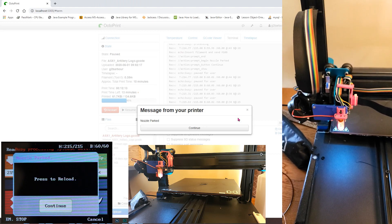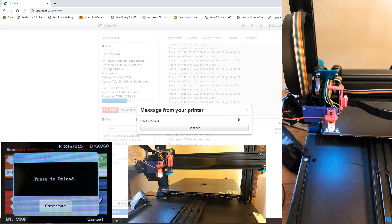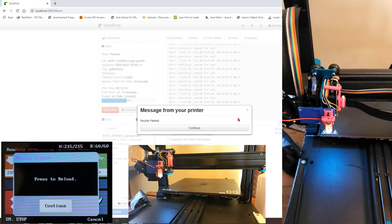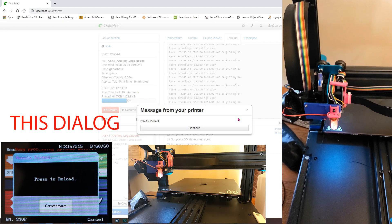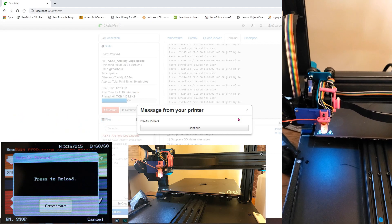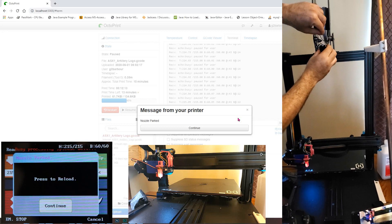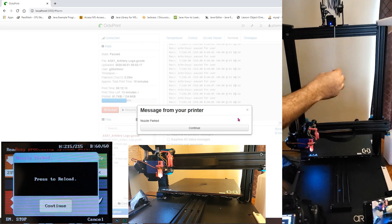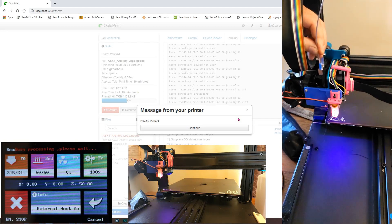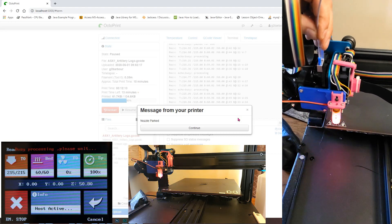There are a few dialogues we have to worry about and a few that we don't. When you run an M600 or have a filament runout event, the first dialogue tells you that the printer is paused — no response is necessary and you can basically ignore it. The next one tells you that the nozzle is parked, at which point it's waiting for a user response to decide when to start feeding filament back in. If you don't respond in time, Marlin will time out, go into standby mode, and turn the heater off until you respond to the next dialogue. Both of these dialogues expect an M108 in response, but I found that using M108 was kicking me out of the process, so I switched to M876S0, and that turned out to work well.